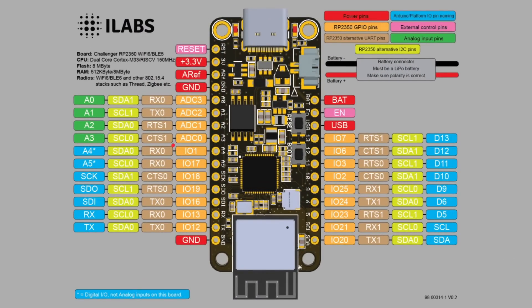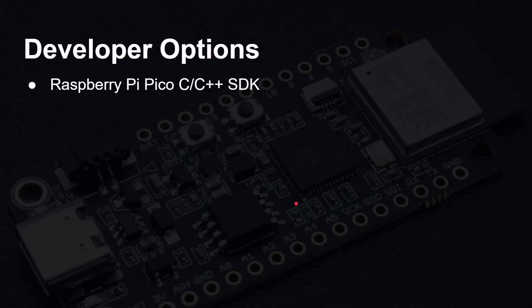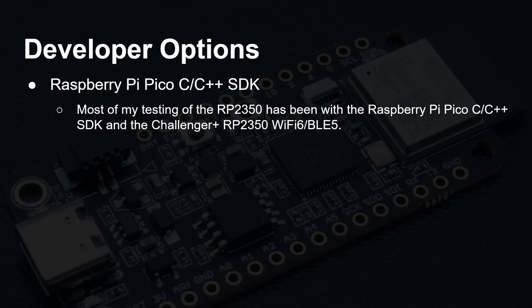Here's a quick pinout of the board. Down the left-hand side, you've got a reset pin, some voltage pins for power, and various GPIO pins that can be used for serial, SPI, and analog. On the other side, there are battery-related circuits, a USB pin that can power the board — you can put five volts in there — and the C6 module with its antenna for Wi-Fi. There are also a couple of LEDs: one showing battery charging activity and one user-programmable LED.